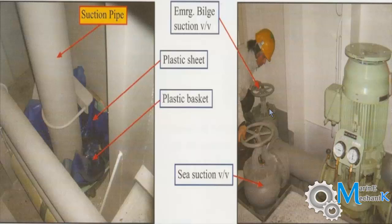We are checking the capacity of the pump by this test. The main point is whether the highest capacity pump in the engine room — the main seawater pump — has sufficient capability to pump out all the bilge water and discharge it overboard. Calculate the quantity of water in the canvas and the time it takes to empty it completely. That gives you the bilge discharge capacity of the pump.